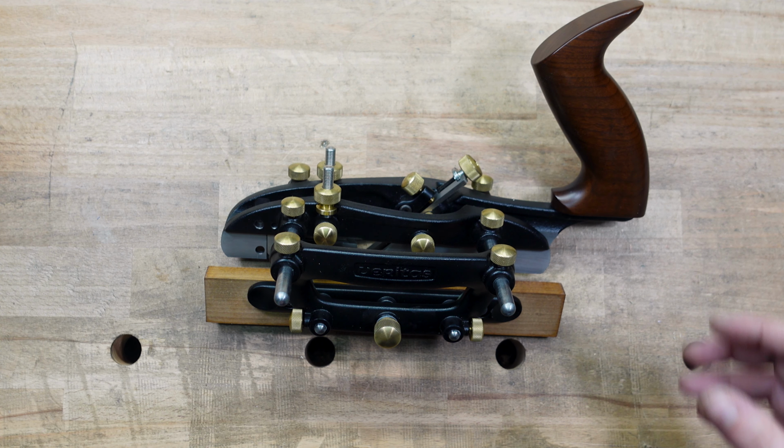Next, we're going to look at the fence. Now, I don't know why I put the Johnson's away because I'm going to use this again. So for the fence, one of the things I do is I actually wax the fence itself. So just take a little bit of this again. And the reason for that is, oh, see, I got the chunks. Good enough. So the reason I'm waxing this is because this is going to ride against the wood and I want it to be a little bit smoother.